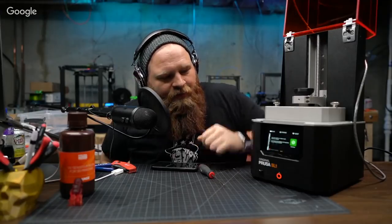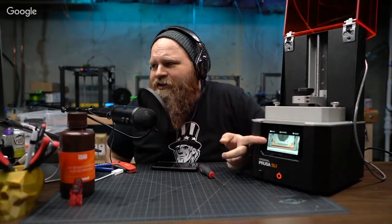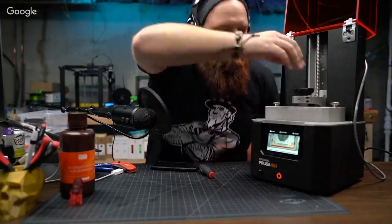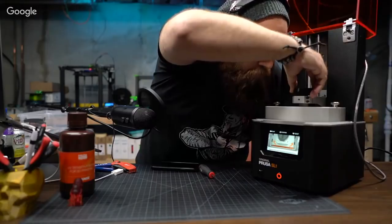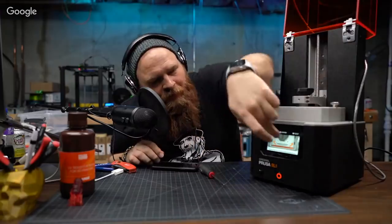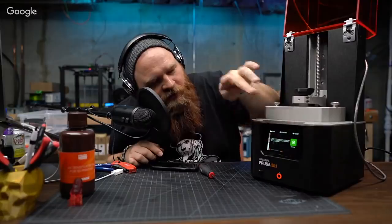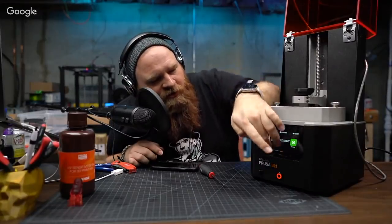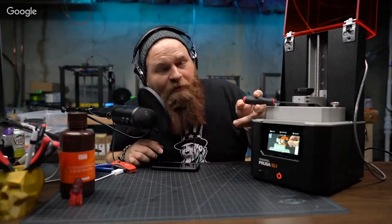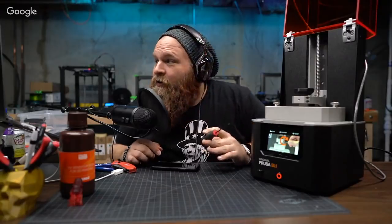All right. Now let's look at the picture here. It's going to want me to line up the edges. You can actually kind of see that. It's kind of crazy. It wants me to line up so that way it's nice and straight. Close enough. And then tighten the small screws. Be careful to tighten them each individually. Or they want you to basically tighten them at the same time a little bit. So a little bit here, a little bit there. That way when you tighten down the bed, it's tightened down correctly.